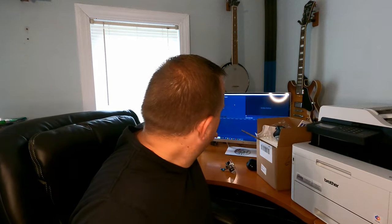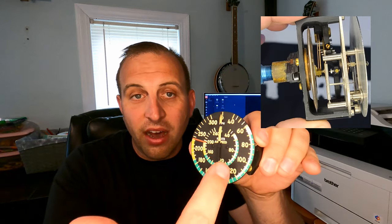While I was waiting for that, I took the housing off that was cracked of the airspeed indicator. What I want to do is run you through this contraption — show you how this diaphragm works, how this linkage works, the colors on the display, what they mean, why there's two different arcs, and kind of run through some tests to help you understand the errors that can happen with an airspeed indicator or how it normally functions.